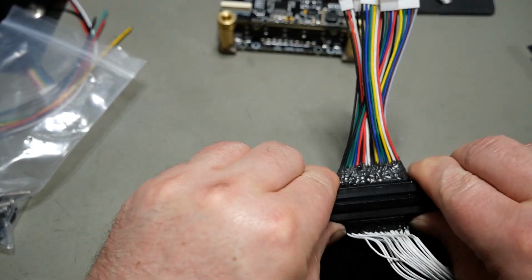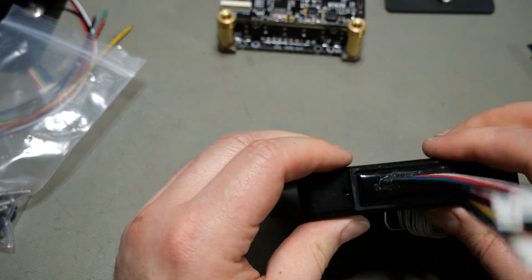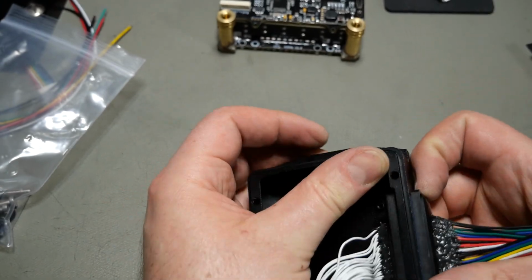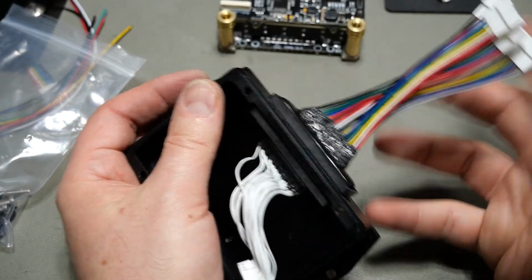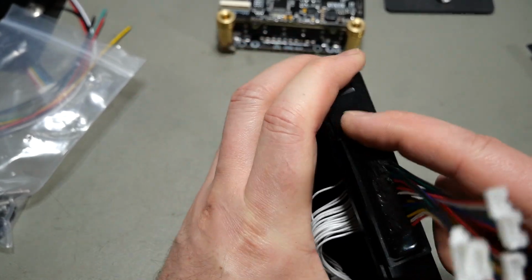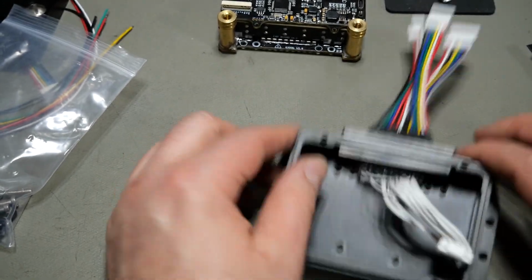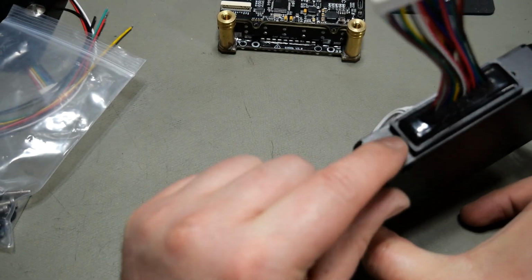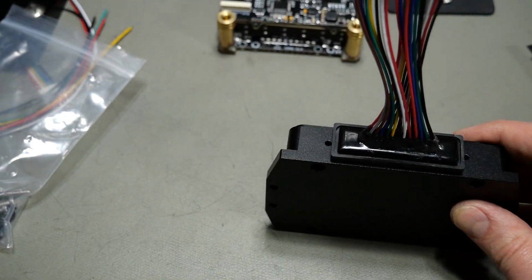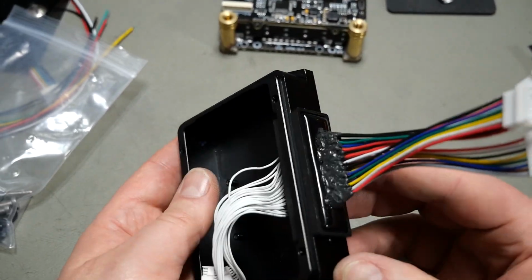Yeah, and that's with me squeezing this stuff together and then pushing this way, because this piece back here would be screwed down, and now you have that gap in there. So this piece right here can't be compressed aluminum to make a watertight seal because you have that gap between the two. DB25 is not waterproof, and yet they've got this O-ring on there, but they don't have little ears on here to secure this through those two M3 screws, in which case you'll have a water gap and whatever else to bugger up that DB25 connector. So close. Just put ears on here so that these two screws can go through those ears and secure this in place, and then I would say that's not going to be a water incursion problem. But as is right now, it's a water incursion problem.